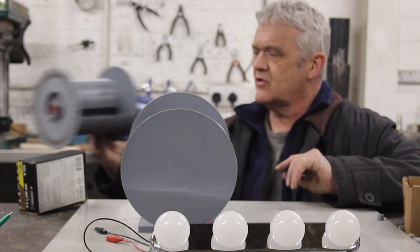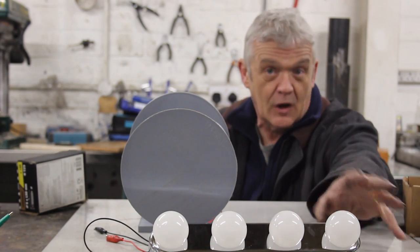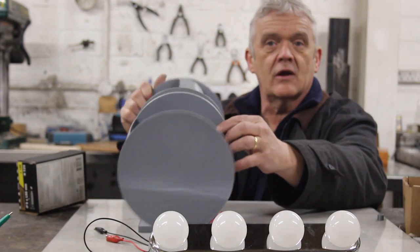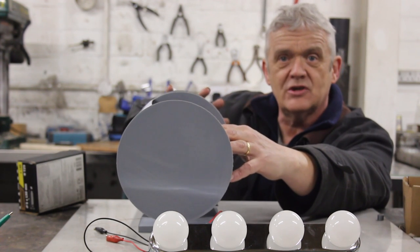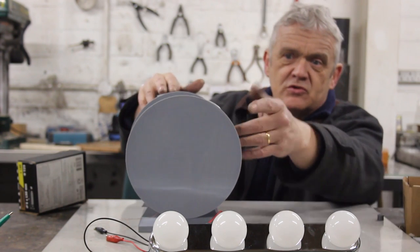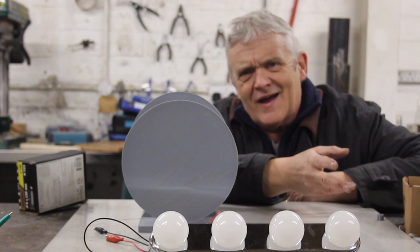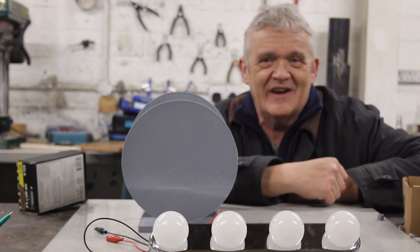We tried one of these and found they've got about 2 volts or so. Now, this thing here takes about 6 volts to light up. So if we can light that up, we're doing a hell of a lot better. I've rigged it up here with the two sides to spin. They will magnetically lock when they're close enough to each other. So if I apply a fan on this section here, the mag lock will make sure that they both turn in the same direction. If I move the wind to the center so it's distributed — one bit hitting this section, the other bit hitting this section — they will contra-rotate. So we're able to look at when they rotate in the same way, which would be like an axial flux, or when they rotate in a contra. Let's have a look at the axial flux rotation first.